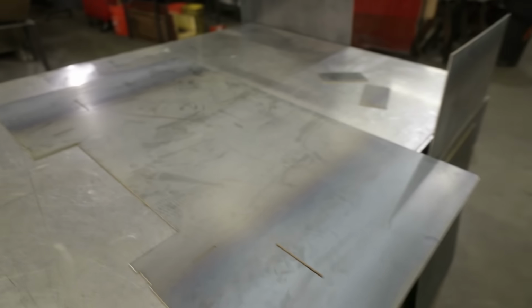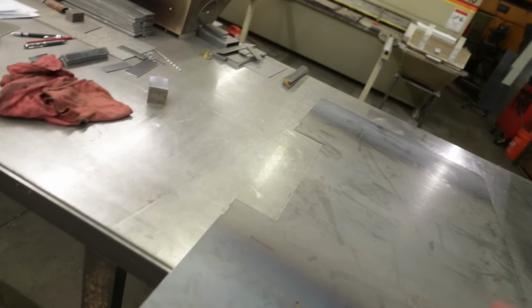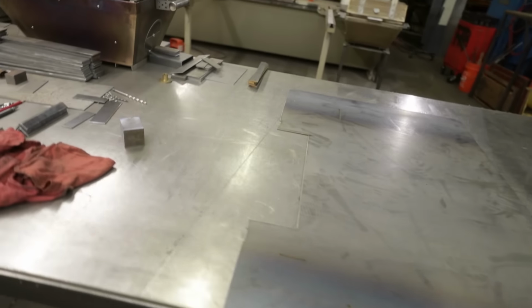So it's over an 1/8 inch thick. But this is going to be our Firebox. We bend this up into the main shell, and we bend a backside piece that snaps into place, and then we weld it. Then we'll put it in the grill, we fully insulate it. So now it is a true fully insulated Firebox.